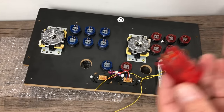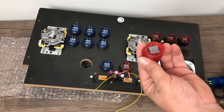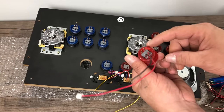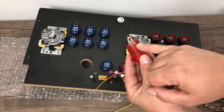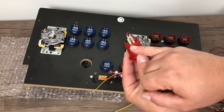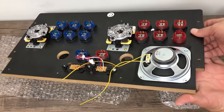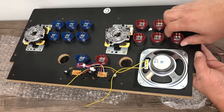Moving on to button wiring. Depending on the kit you get it could be a little different — usually when you buy a kit they have some kind of manual. Since this is an LED button kit, there are four pins on each button: two for the LED and two for the switch. When you're wiring up a switch, it doesn't matter — it's not polarity sensitive, so you can put the red on the black or black on the red. For the LEDs, it does matter — they are polarity sensitive. You will have to put positive where positive goes and negative where negative goes. Follow the manufacturer's instructions or find something similar online. With screw-type buttons, I put it through, grab the plastic nut, screw it on the collar, and make sure everything's flush.